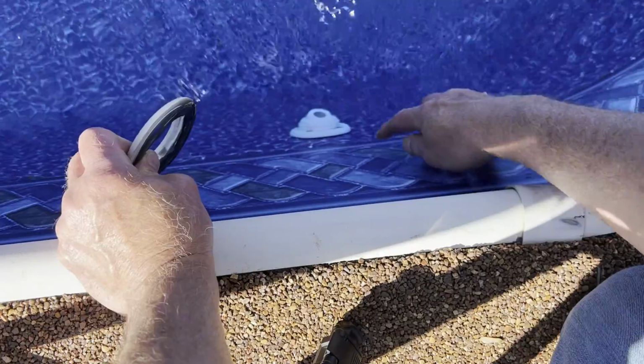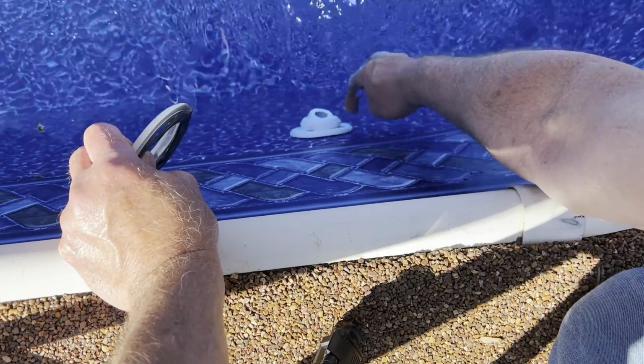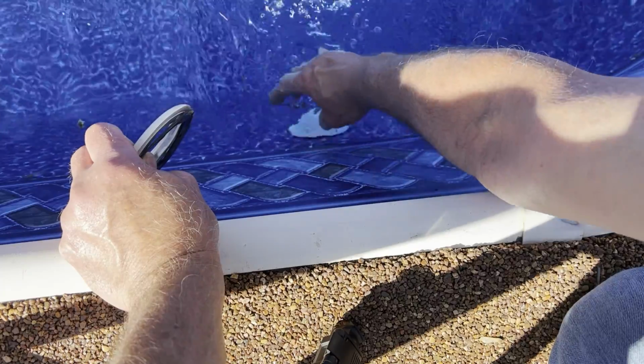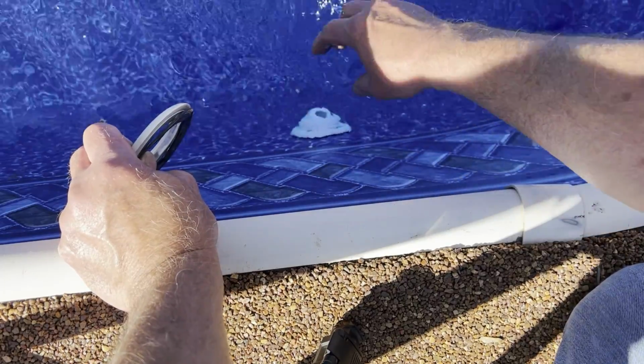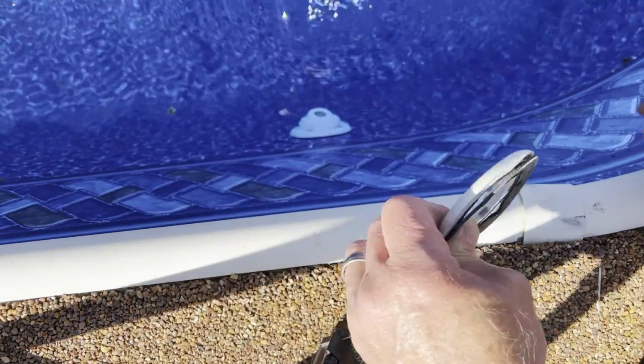and then line up your gasket and your cover with that indention, and then pull it back a little bit and feel for the screw hole where it would be, and then start your first screw and then feel for the other side for where the hole is, and then start your other screw on the other side, and then the other ones just line up.